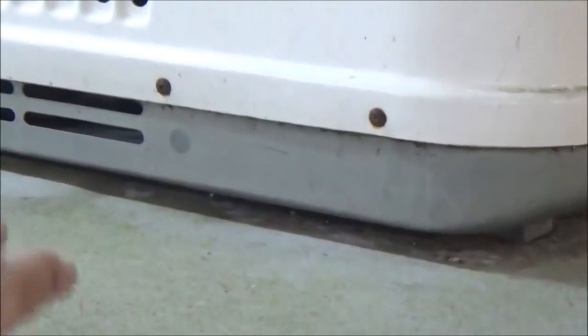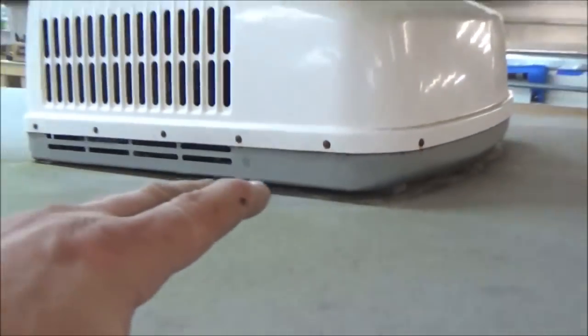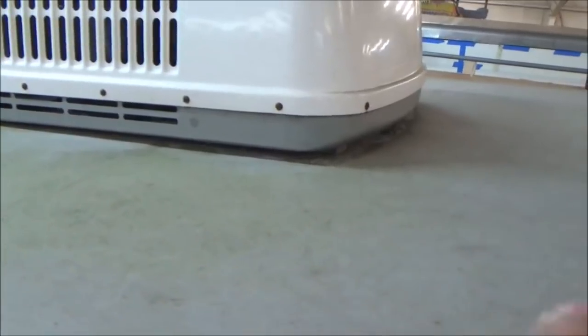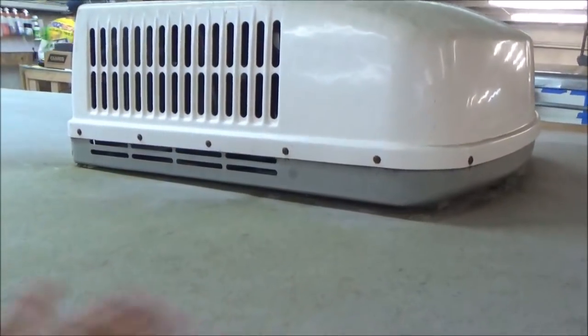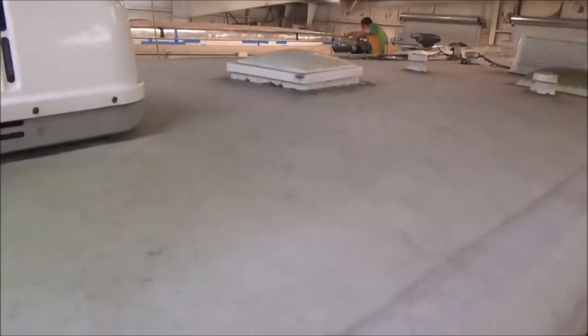There's a little twig right there, some more up here, a tree branch — all that's going to get up underneath the air conditioner. When it gets up underneath there the water gets there and it starts to rot and mulch out, becomes mud. That air conditioner is still going to want to drain but it cannot drain from the ports up underneath there — it'll back up and get into the roof. The purpose of the curbs is to elevate it, help you get better drainage out of your AC, and keep rain from getting up on top of the curb. That's the way a flat roof functions — this is just not the way you do a good flat roof.